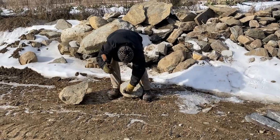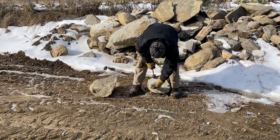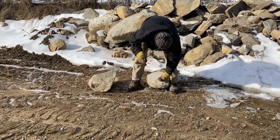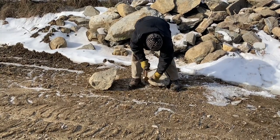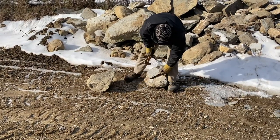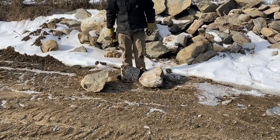Now if you're looking for a super precise break, gradually moving the chisel all along the break can help achieve a super straight break right at the edge. I'm not being too fussy, as is typical in dry stone walling. There we go — we just cracked that piece on the natural crack that it had in it.